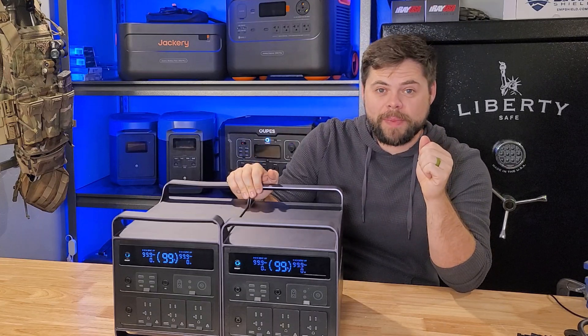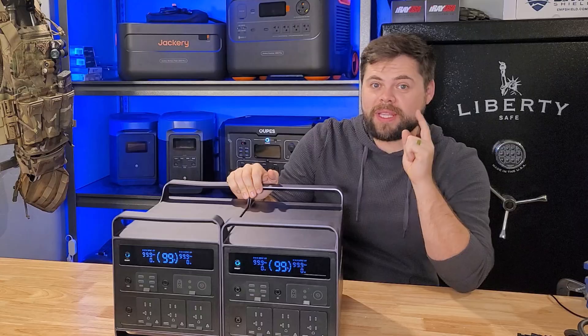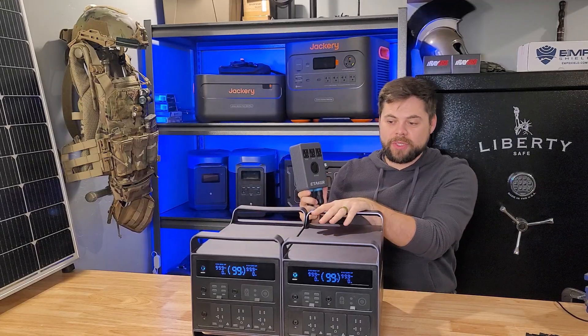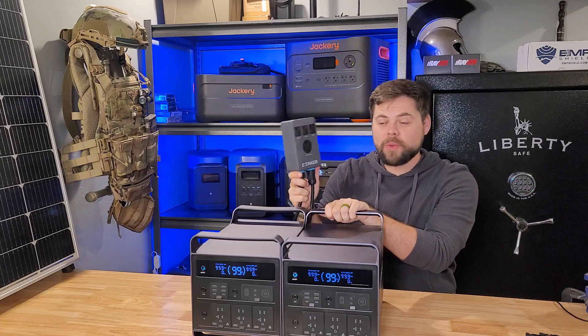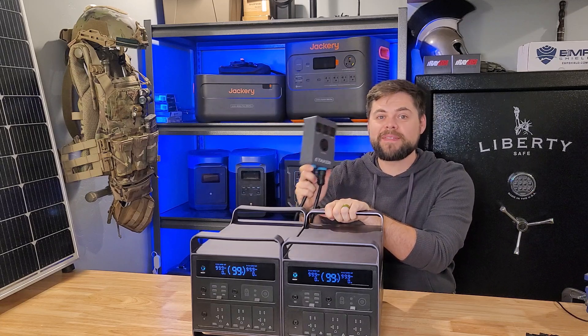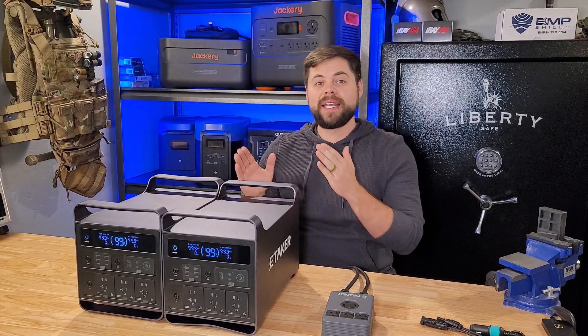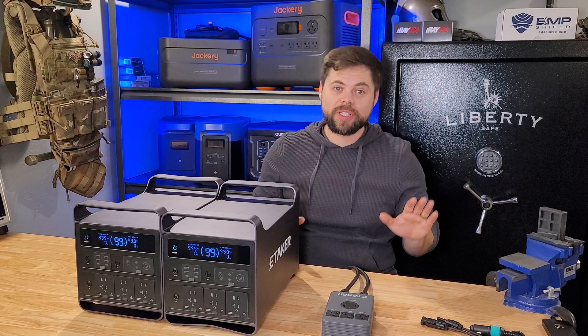I always love to see a match between battery and inverter capacity. But even more impressive is this adapter — with these two tiny units I'm able to get 120/240 volt split-phase power. Basically, I can connect this to run all of the circuits in my house, getting 4,000 watts of AC output, which is just your normal wall outlet power.